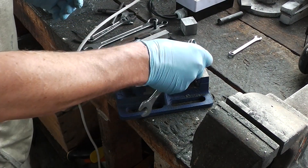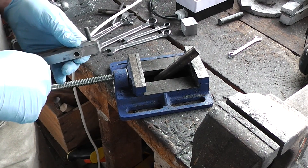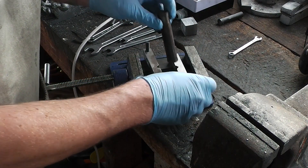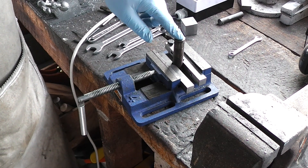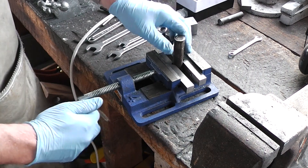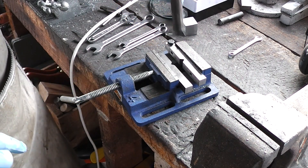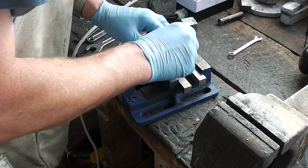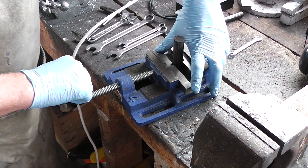And I'm going to make it out of this round steel stock. I'm going to use these V-blocks to hold the stock. I need a 6mm through hole here and a couple of holes for the set screw. Before I get too carried away, I better check if all this fits in the clamp for the bandsaw. Yes — just. Very important, because I really don't want to hacksaw through that myself.